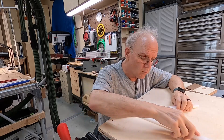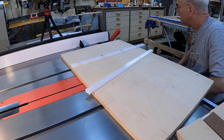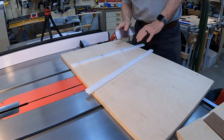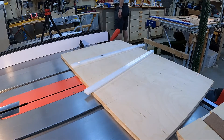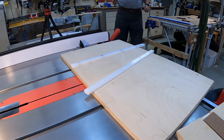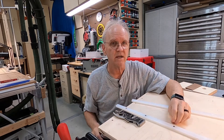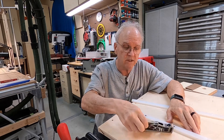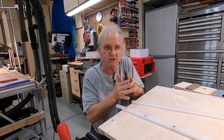Once it spreads out you want it to be fastened down really tight, and that spreading tells you it's tight. But then you're going to have to use a shoulder plane. I used this little shoulder plane to cut the fat parts off — you don't want to shave down the whole side because it'll get too loose and wobble around. You just want to get the little bump off at each place where the screw is, and the shoulder plane is good because the blade runs all the way to the edge on both sides.